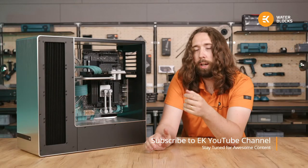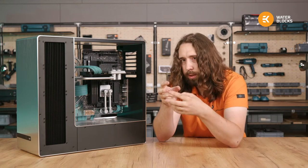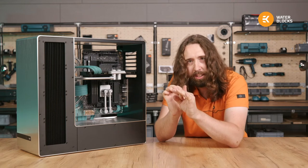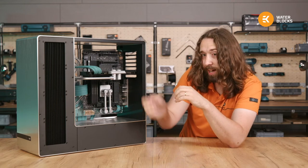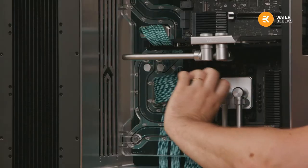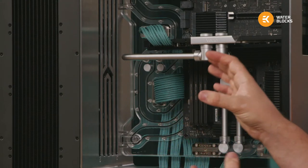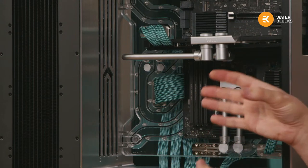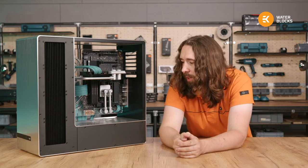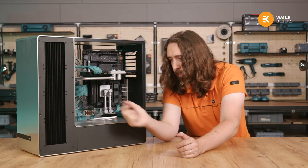and then threaded them through an old 24-pin crimp housing. So pushed them through and drilled a hole through it so they were just tight. And when they were tight in the first place, I then did that again where they go through the second place, and put all 24 wires through and set the wire to the right length, and then taped it up at the bottom so they couldn't move. And then when I had the top half completely set and all the wires right, and I'd pulled each wire through just the right distance that they would have the right curve, then I took from the position they went on this mocked up 24 pin that was then hanging out